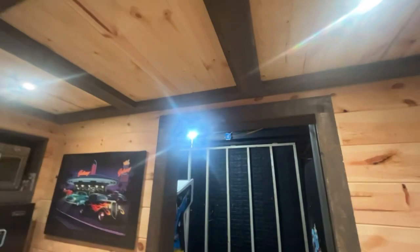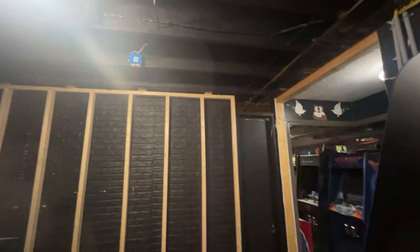Now I'm going to start working on the ceiling in here. The ceiling is made up of two two by fours stacked together, laying sideways — so three and a half by one and a half, two of them coming down. And then this is a piece of rough sawn pine at the bottom, but the rough sawn pine doesn't go on until towards the end. Basically what I need to do is come down two two by fours, but because I have pipes and stuff I need to come down three two by fours — so I need to make a grid of three two by fours down.